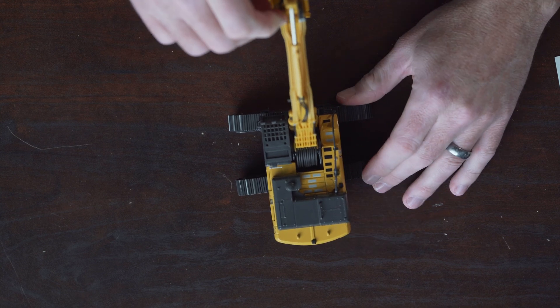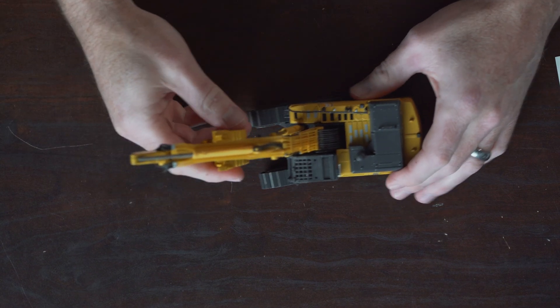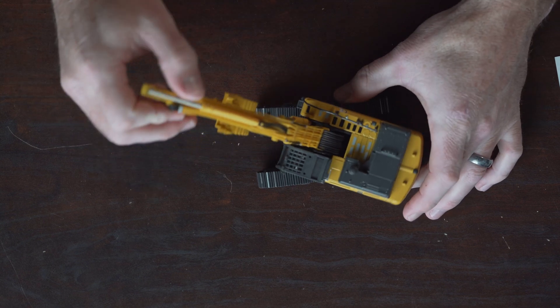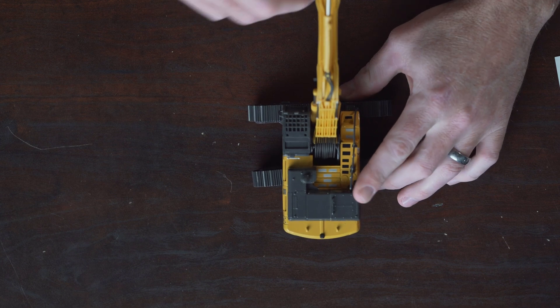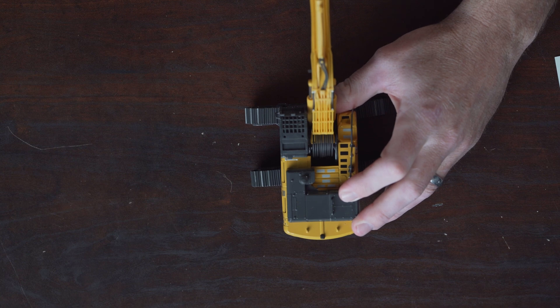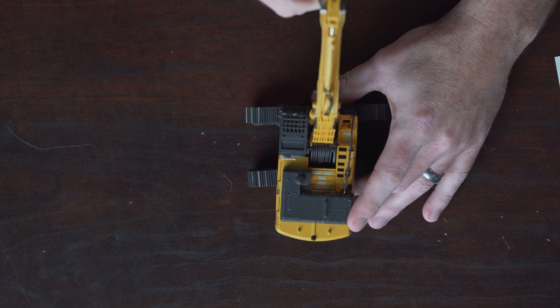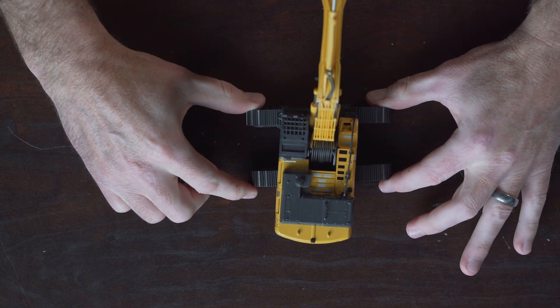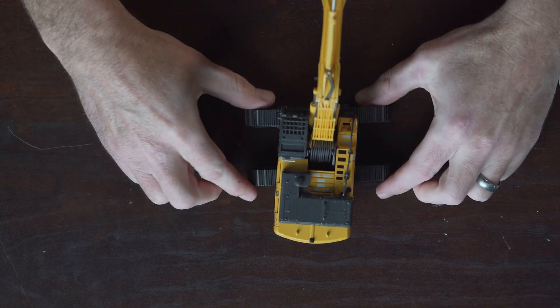The way to avoid that is again: bring that load into you. If you're going to swing fast, bring the load in just a little bit — you don't have to tuck your arm all the way in, just enough that it's not going to make you super tippy. Then once you get out over the side, apply the concept we just learned: if you need to reach way out there, boom down at the same time and then let your bucket out. When operating over the side of the machine, be aware of your track base — look at how long it is front-to-back versus how short it is side-to-side. You don't have nearly the same track base, and that's why you're always more prone to tipping over the side.